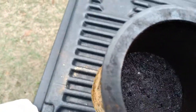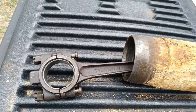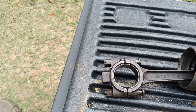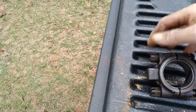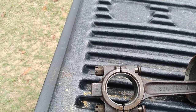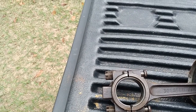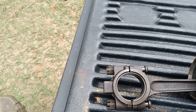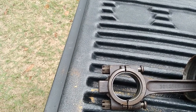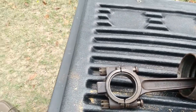It's pretty rusty in there. We pulled the pan off last weekend and went to pull the rods out. The rod bolts were all held in with original castle nuts and cotter pins, and they were all extremely tight - I thought it was a bit too tight for rod bolts. The cotter pins were clearly 1951 vintage - hard as rocks, nothing like modern ones. It took forever to get the things out.